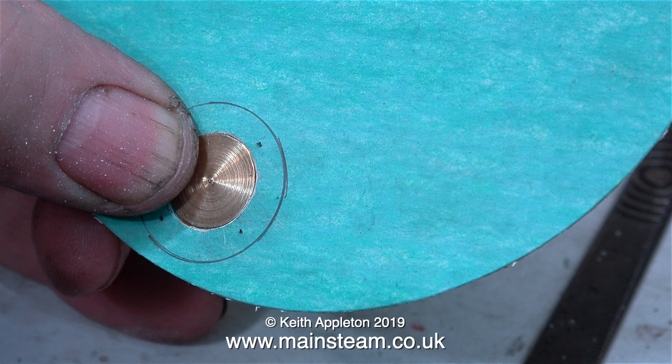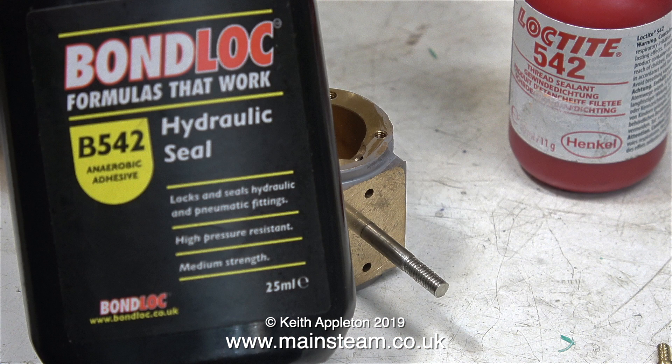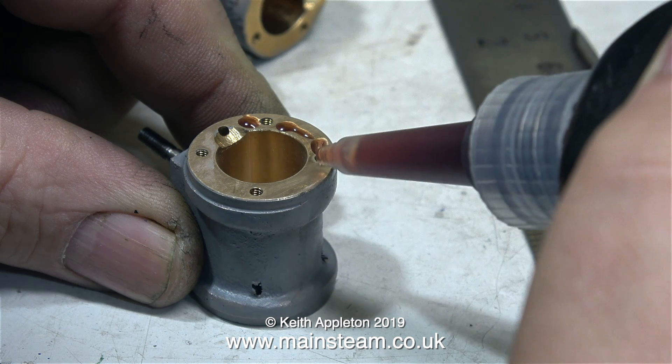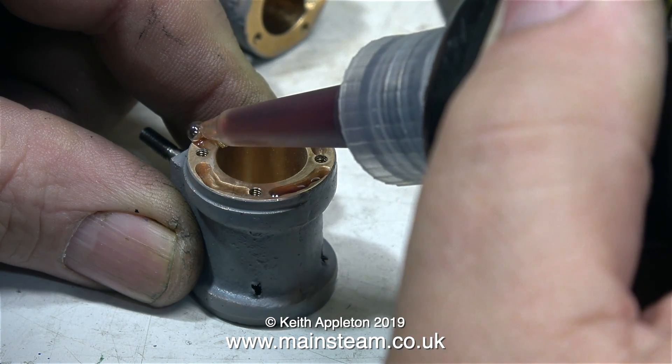But this gasket material is far too thick. I think I'll put the top cylinder cover in place and use some of this — it's called Hydraulic Seal, an equivalent to Loctite 542. It looks the same, smells the same, and tastes the same. Health and safety warning: do not taste this product, it's probably poisonous. That was a joke — in bad taste. And the pun was intentional.